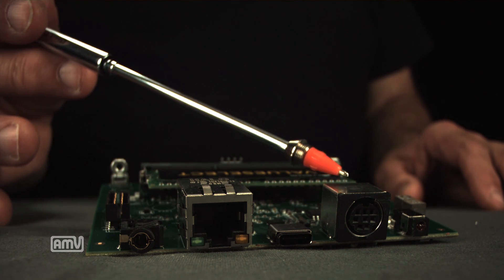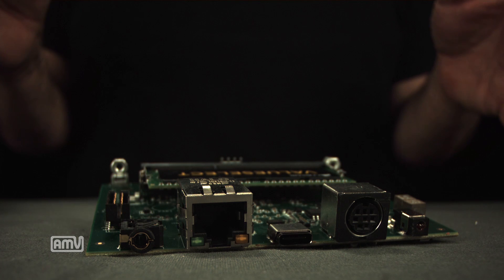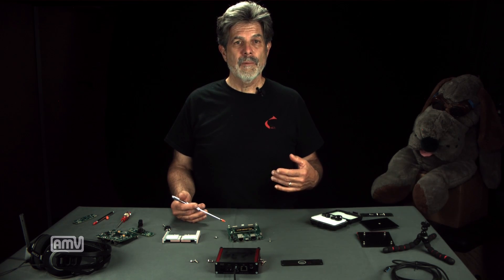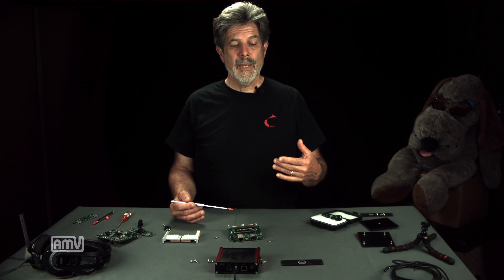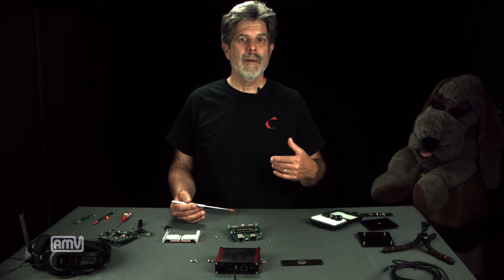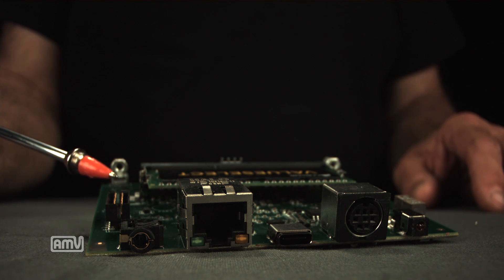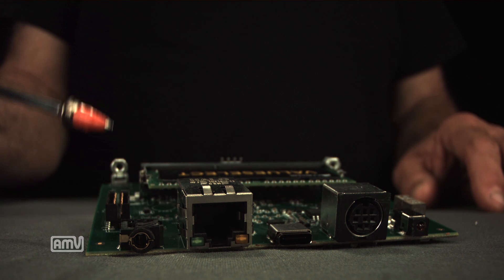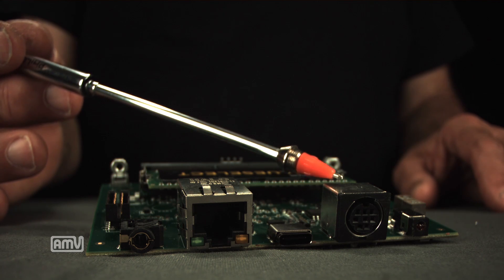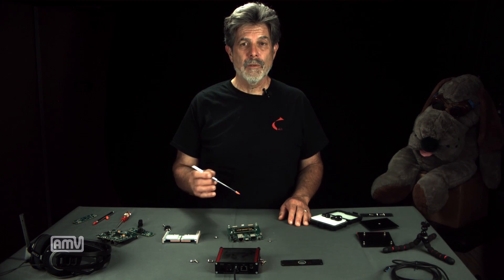This next connector is really interesting — it's an 8-pin auxiliary I/O connector and its first function gives you direct access to the timing features on the CMOS sensor itself. So if you want to sync the camera to something, strobe, trigger from the camera, or control power standby, power up, and power down of the chip itself, all that can be accessed directly through this. We also have a row of JTAG connectors, and in the next version we're going to replace those with jumpers that allow you to access the FX3 and the FPGA for programming when you're not using the USB. We chose a USB 3.1C connector because it's universal — there's no up or down, so you can't make a mistake when you plug it in.